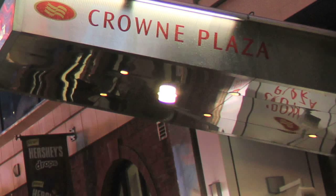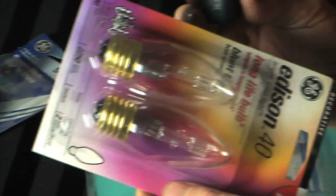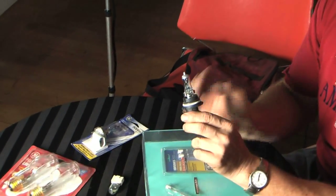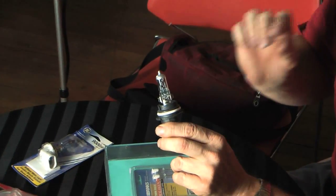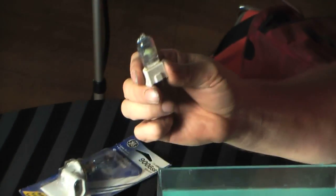The only main disadvantage of this lamp is that they run extremely hot, and they're better off put in an outer envelope, like these types are for household use. Also, you can't touch the bulbs with your fingers because if your skin oil gets on the quartz and it gets hot, it goes through what's known as de-vitrification.